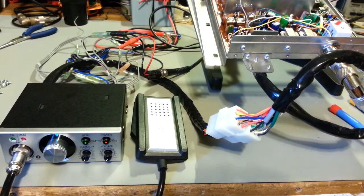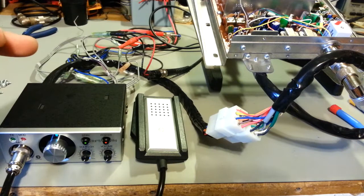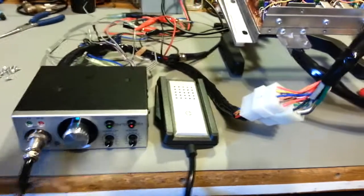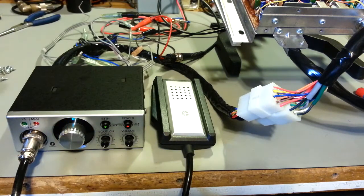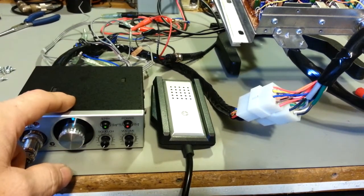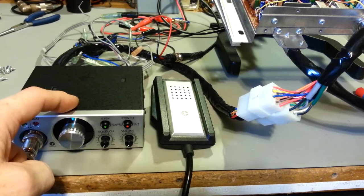I guess if you were so inclined, you'd have to get a BCD channel selector switch, because this PLL chip uses BCD-type programming. So you would need basically a 40-channel channel selector out of any radio that had used either that chip or like a UPD-858. But it would need to be small enough to fit in this box, but basically that's what you could do. Remove the existing channel selector switch in this, stick a 40-channel BCD-style channel selector switch in here.